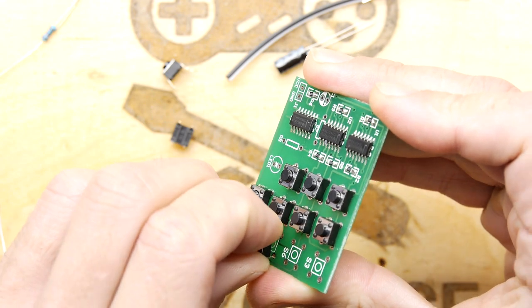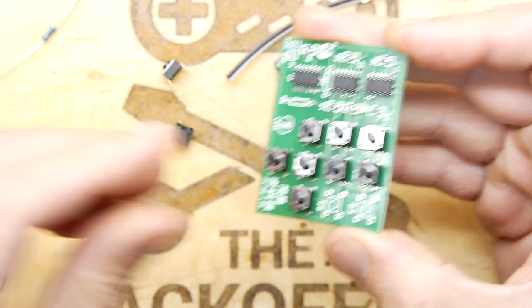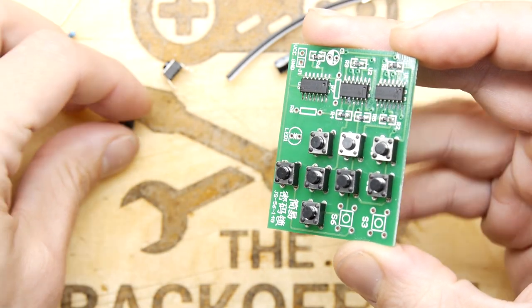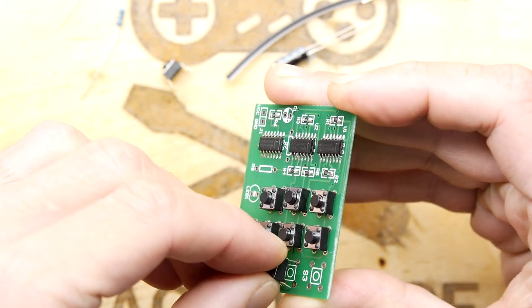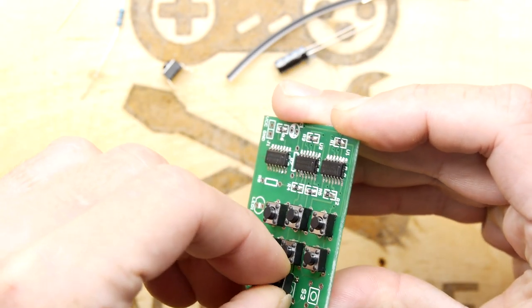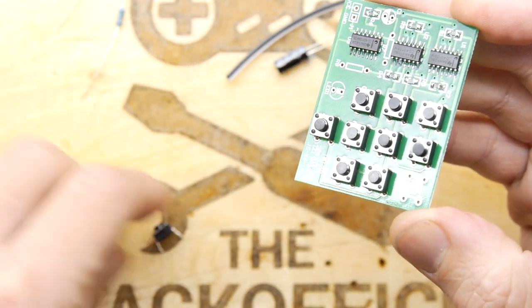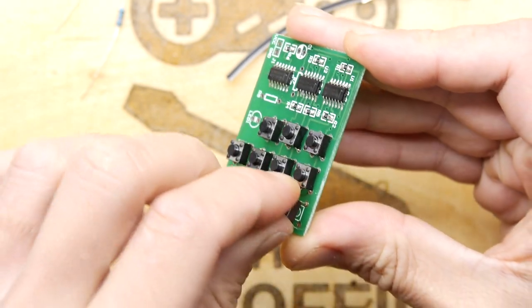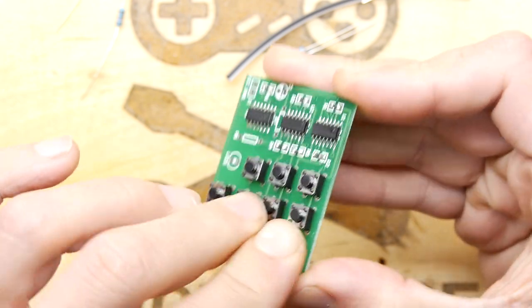Come on. Now, if you ever see these keypads on buildings, more often than not they're really sort of pants, in that if you manage to lever off the keypad, you can just short the contact wires and just get in. A lot of them don't relay the code to some sort of remote system that detects whether the pin is correct or not. And it's sort of lame. It's like pin checking at the failure point.